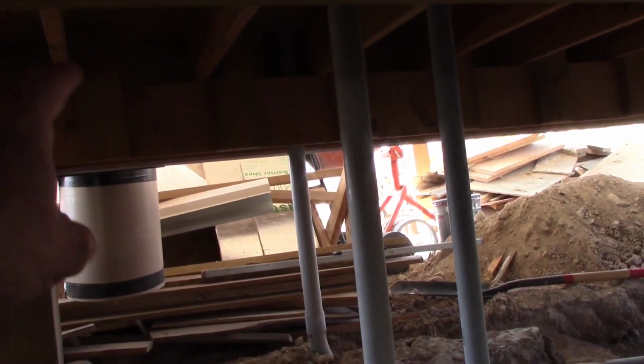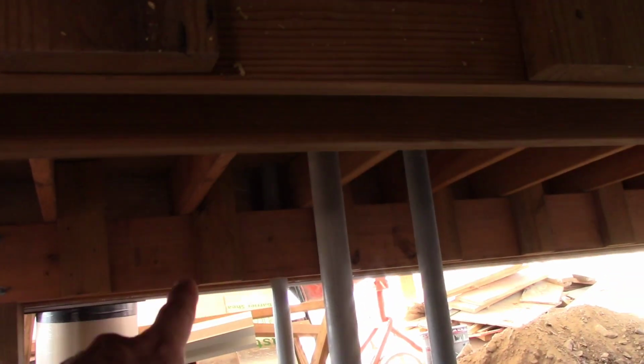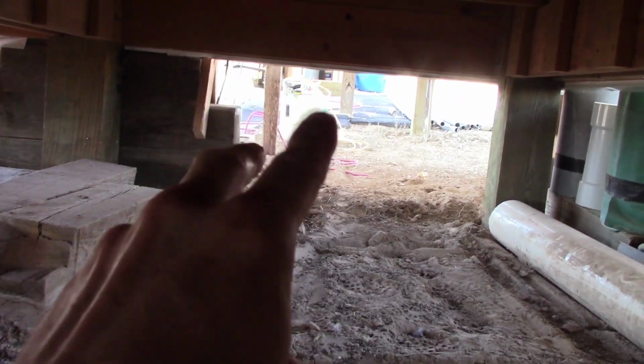And then off of that same junction box, all the EMT metal conduit for receptacles, lights and all that throughout the building will tie into that junction box, and then I'll just run one 2-inch up through the floor instead of having all those EMT running up. It'll make it a lot easier, and that's how I'm gonna do that. So I'll have to get that junction box and put right there, and I'll just glue a male adapter and transition to that. So another 2-inch across here, and then on that side of my heat exchanger off of my wood burning stove, I've got 2 more conduits that are gonna run over there.